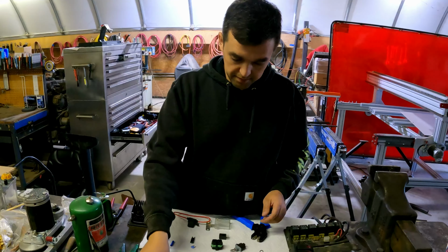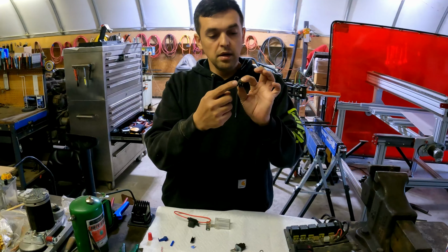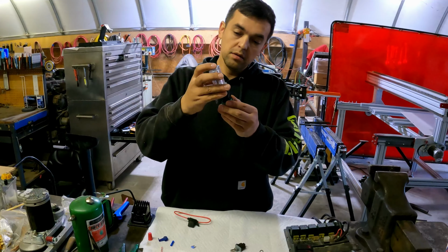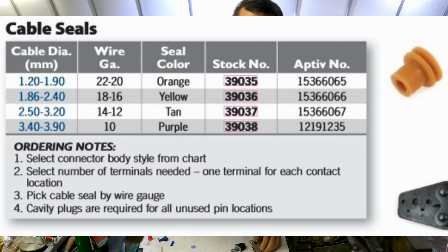Anything that I use for, where I need one relay, one circuit breaker, I use this kind of style. So this is a one relay, so you have an input and a ground, usually 12 volts and a ground. 12 volts goes to your switch, and then it connects two switches. It fits into one of these modules, and then you fit one of these resettable circuit breakers. And then once you find a place where you want to mount it, right there, there's a nice seal right here. It's watertight. And for the connections, the wire goes through a loom, basically.